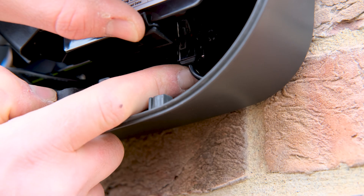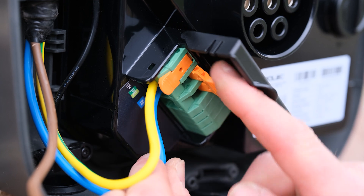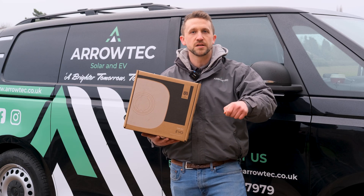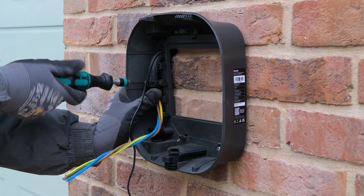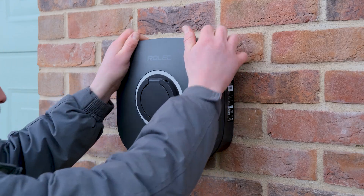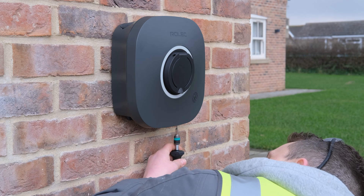There's no need to strip the cable and potentially damage the connections. The mains wiring is also on push-fit terminals, so again you don't need to strip them back and potentially damage the strands of the core. The strain relief is really easy to clamp in, and the lid — the screws are not on the back, they're at the front — so you click the lid on and just pop two screws in underneath.